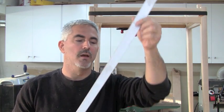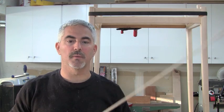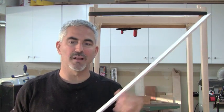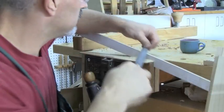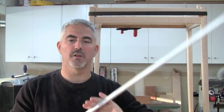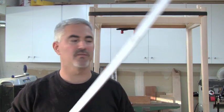I worked on my template to define my curve. I used to rush through them because I wanted to get back to working with real wood, but I have since learned my lesson. I take my time and get a template just right — smooth, no bumps or undulations on the edge. Do a nice job on the template because everything else is going to follow that template.